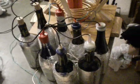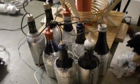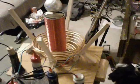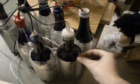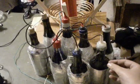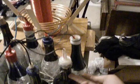As you can see, coming out of the transformer. The capacitors we're using are salt water. We've taken eight wine bottles, covered them in tin foil, sealed the tops, and put a straw in so that the wire could stick down far enough into it — mainly to keep it from hitting the sides. Filled up to about here, higher than the foil.